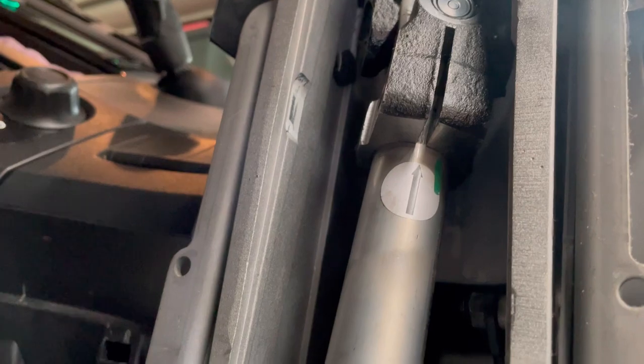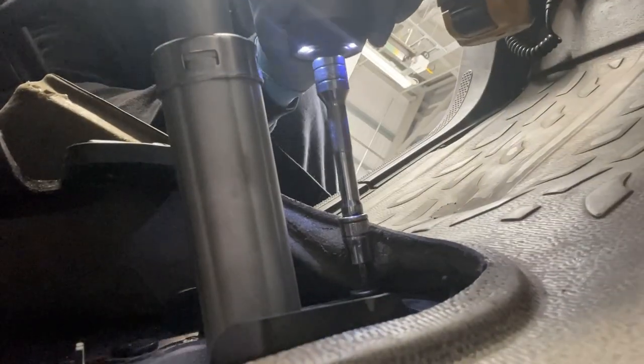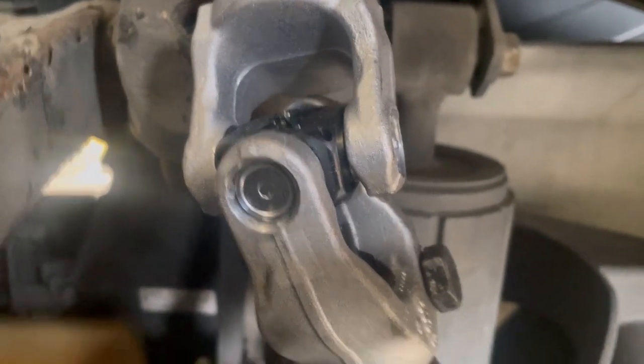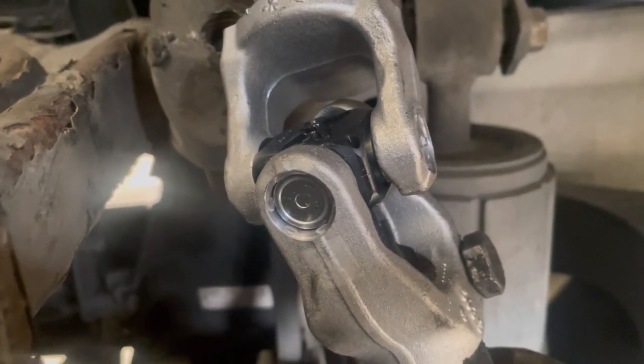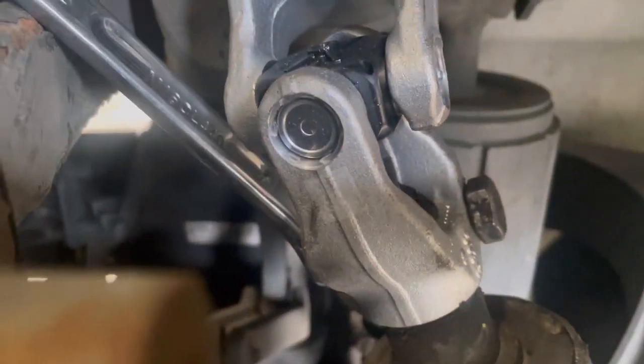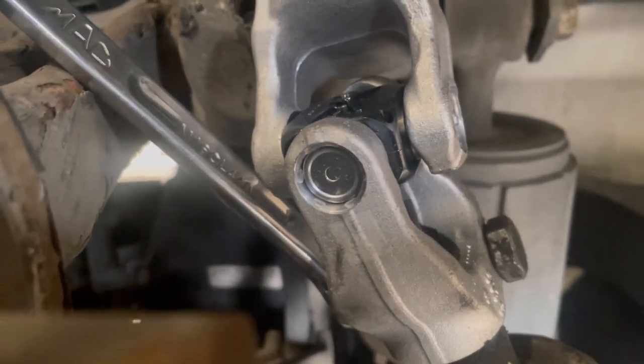We've got a pinch bolt in now, do everything up. And then we'll refit that as well. So that's the top one done. It's hard to balance this, but I'm going to get that one done up. So remember, for the nut, 16mm and a 17 for the bolt.